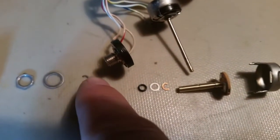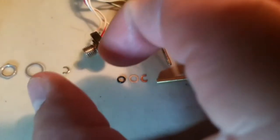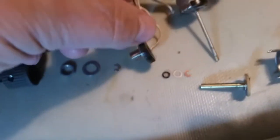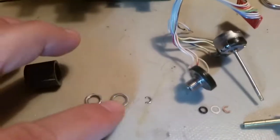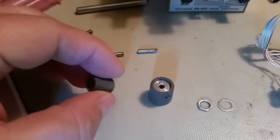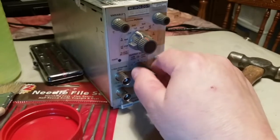After you get this through that, then you can go ahead and put this washer — the lock ring, lock washer, whatever — slide it down there. What that does is, between those two, it keeps it centered in here so that it can't come out, can't go forward, and it can't go back. And it makes sure and puts a lot of tension on these wipers right here, so that they are in contact with the resistive compound on that disc. Then you can go ahead and mount it in the hole right here for the PG-502, put your nuts on it, and then put your outer knob and then your inner knob, because it kind of goes on the inside of this one here. And then it would look like this one over here, and you would be able to make adjustments.